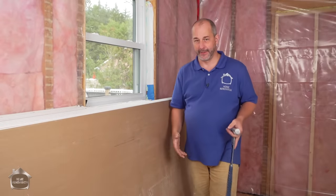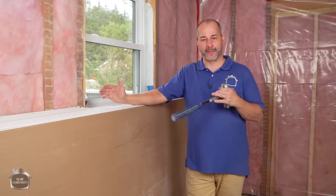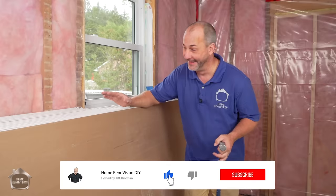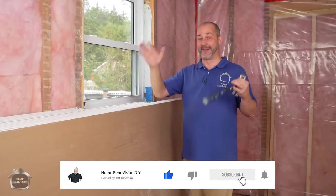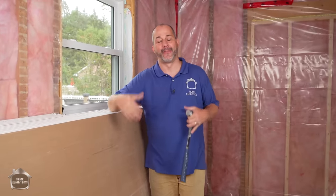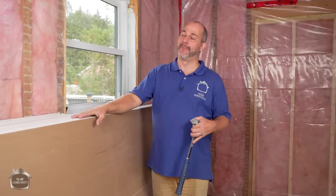So when I'm bringing drywall into a house, I like to stack it up against the wall, not on the floor. And that's generally because it keeps it a lot cleaner. You'll end up using it as a ladder, and it's just not necessary. If you're using a drywall lift to put your drywall in position, you don't want anything on the floor in the room. That's what I like to use. I'm a big fan of using the machine to lift my ceilings in place.